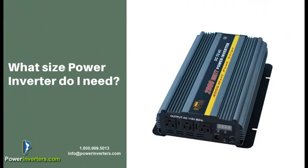Calculating your power inverter size is pretty simple. You're going to take the AC load applied and calculate it based on that. You're going to want to go about 15 to 20 percent on top of it — add up all the watts that you're going to be using and add about 15 to 20 percent — because you want a little bit of a buffer to avoid overheating.